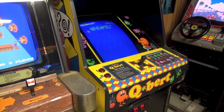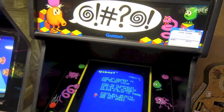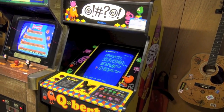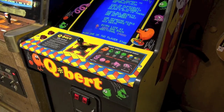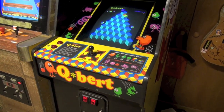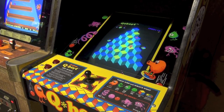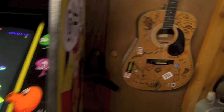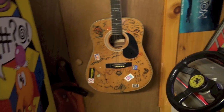I did some tests, I measured the voltage. The voltage in the basement here when all the games are on those circuits — I'm getting around 110 to 114 volts. If I plug him into another outlet that's not on the basement circuit, that outlet is running a little bit higher because it has less of a load. There's not 30-something games running. That outlet is around 117, 120. If I plug Q*bert into that outlet over here, he runs fine. Nothing wrong with him. Game runs perfect.